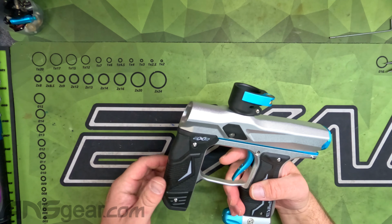If there's no plate there, the screw just goes in the middle of the spring and nothing happens. Nothing changes. If you ever take this cap off, it most likely will adjust where your screw is sitting when you go to put it back together. So I'm going to watch this screw as I screw it back in and make sure that it's rotating along with the cap. If it moves up or down, make sure you readjust that again. All right, we can put this back together.